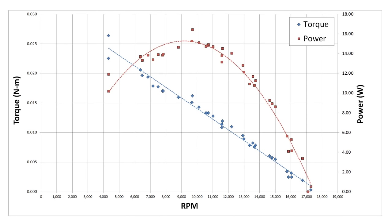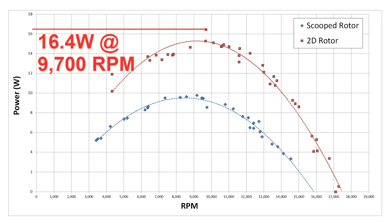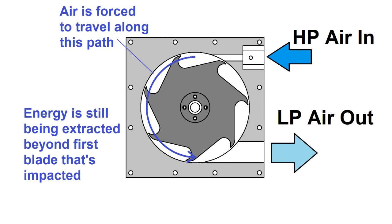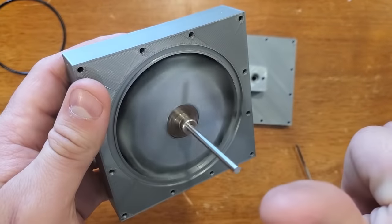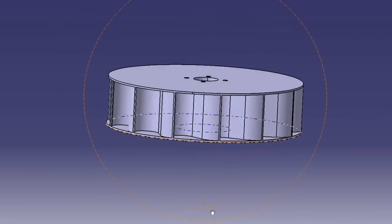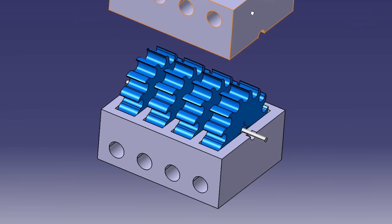After balancing the rotor I got a much better result. In fact, to my surprise the 2D rotor actually outperformed the scooped rotor by more than 60 percent at 50 psi — my highest measured power was 16.4 watts, compared to 9.7 watts on the previous rotor. My guess is that the geometry forces the pressure to stay in the casing longer and do more work on the rotor, whereas with the scooped rotor it just kind of blew straight out. Overall I think this project was a success, and with some tweaking I think I could 3D print turbines that are powerful enough to actually be useful as tools. In my next video I'll be looking at different rotor and casing geometries and also trying multiple stages. Thanks for watching.